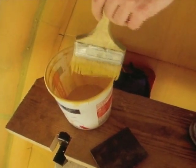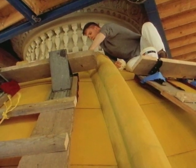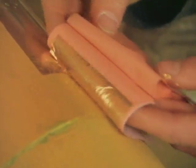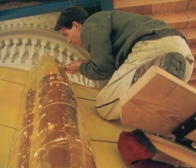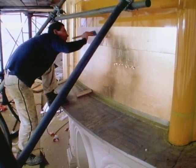Next, artists quickly applied a glue-like sizing by brush. They sometimes had to wait days for a reliable stretch of moderate dry weather, because gilding is sensitive to humidity and temperature. The paper-thin gold leaf will adhere to the sizing when it is dried to its most tacky between 12 and 24 hours. Gilding hasn't changed much for centuries — gold that's been pounded to a fragile state gets smoothed into place onto some monumental structure.